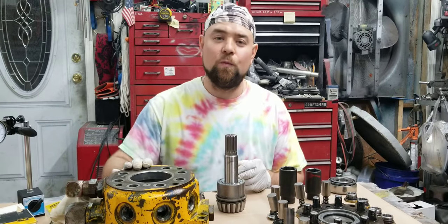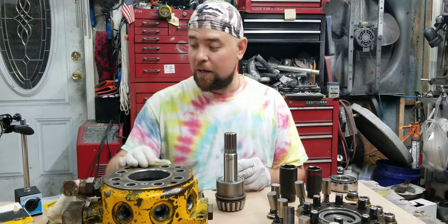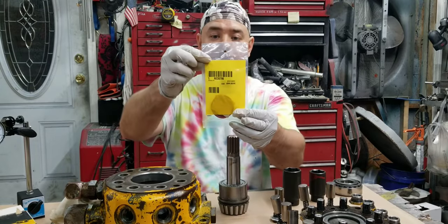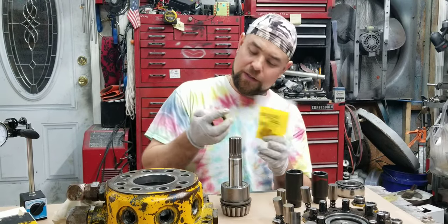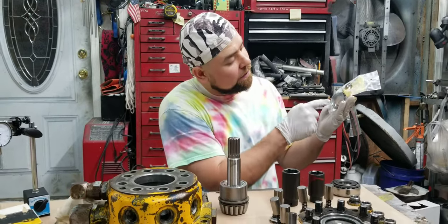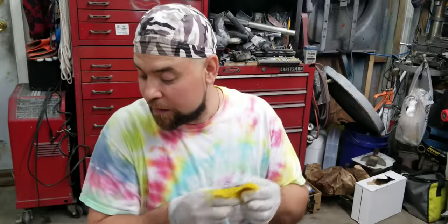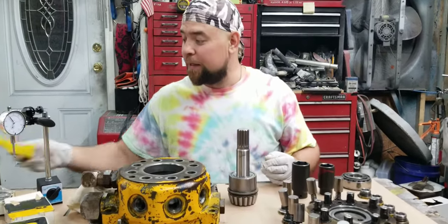We have a John Deere hydraulic pump that I'm rebuilding — about half of it — because the seal on the front started leaking. Here is the part number for it and it's a newer type. The difference is there is a spring inside this ring, and there is nothing — no spring — on the old one. It's a thicker build than the old one, so hopefully it's still a good seal. It feels pretty solid, more solid than this one — maybe it's just better, we'll give it a shot.